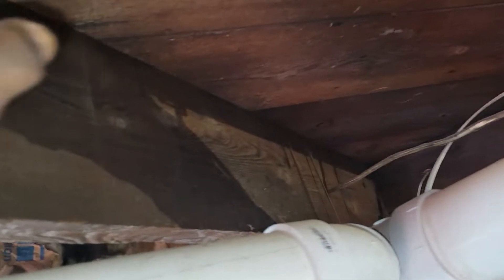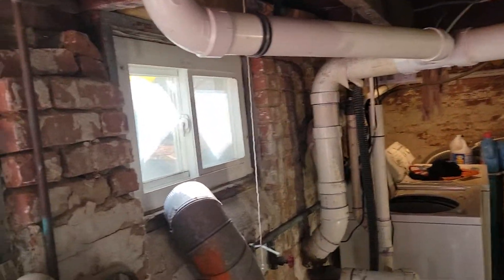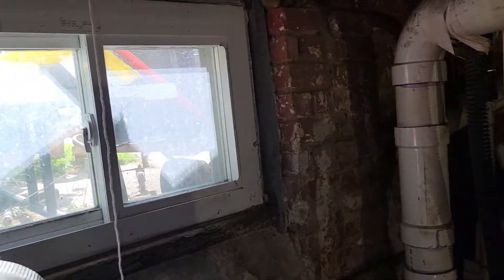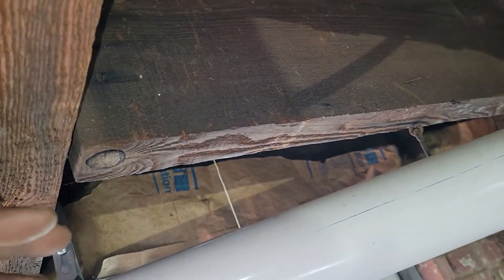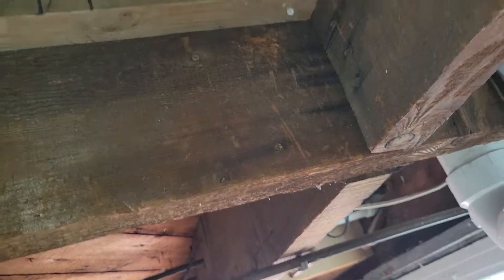Just for air now, so we don't need a two-by-eight — these joists are two-by-tens. I have a piece of wood that we're going to put against and block this area off, probably close off the air going there. The ductwork is going to come this way, turn, go down over the sink so it doesn't hit your head, and then right here in the corner we're going to do the tin knocking to connect the duct to this area. The air will come down, over here, get up in here, and go right up into the bathroom — that's the game plan.